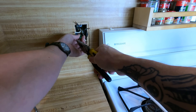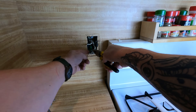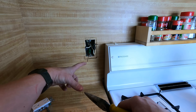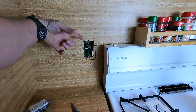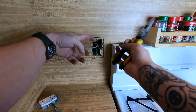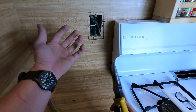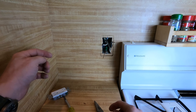What I would have done if I was the one wiring this place: I would have made sure that joint was out here so I had plenty of wire, twisted it together here, and left the wire even longer. I would have left probably another six inches on every single one of those wires so you can accordion everything in, push it back, pull it out if you need to work on it. I'm sitting here bent over this countertop with barely any room — it just sucks to work on. I know I'm just complaining, I'll stop.